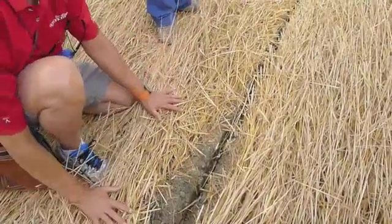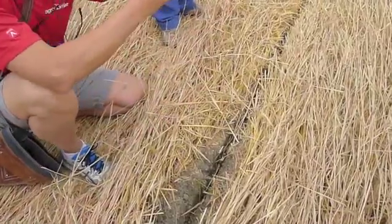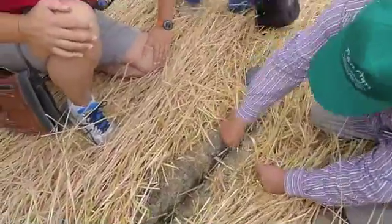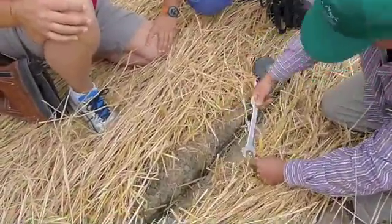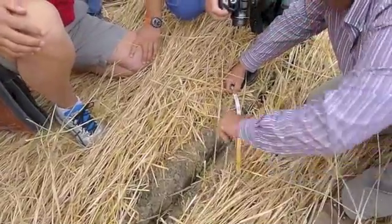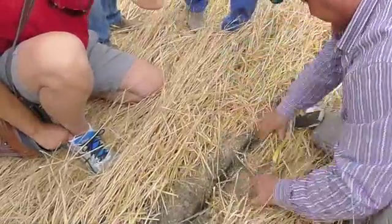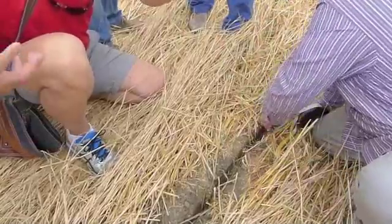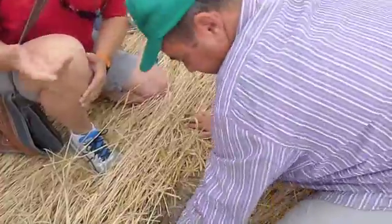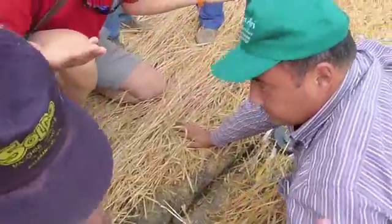If the machine works without moving the mulch, the idea behind dropping the discs down was to make sure it cut the crop. The furrow is 25 centimetres. And you can listen to the engine — it doesn't labour. The tractor engine is not working very hard, exactly because it's not pulling a huge amount of soil.